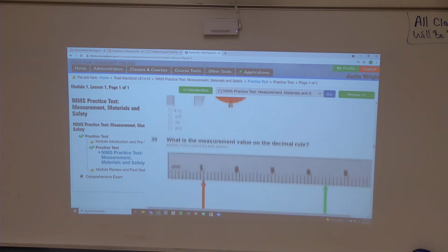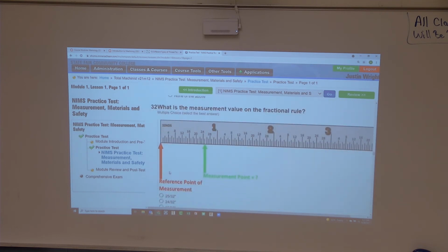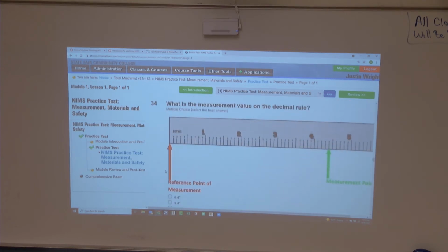On my 2D contours for the finishing pass, should I put the compensation type and wear on that one then? Yes, and then set yours to 0 out there on your diameter. Okay. And then if it's small, then you comp it out. I left 10 thousandths for stock on the pocket. Okay.